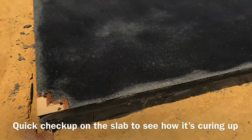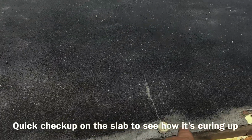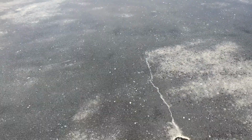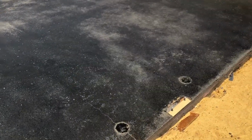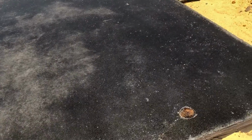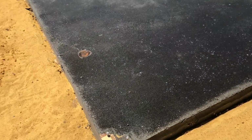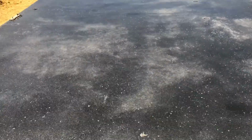All right. It's now 2 weeks after the pour, and we've got a little bit of surface cracking, which we expected a little bit of. Somewhere around the drain vent airlines, also kind of to be expected. There's penetrations through the slab in those locations, so well, that looks pretty good. A couple of bits more cracking over here.